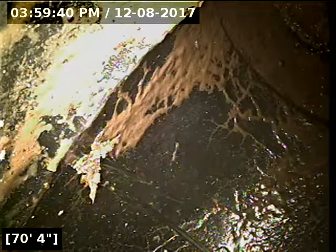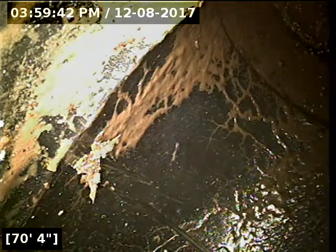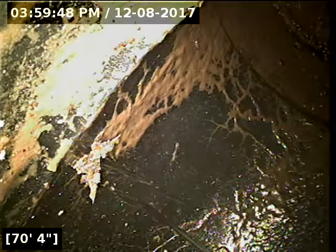A lot of these more rural towns have a variation or a STEP system — it's basically like a half-septic, half-city sewer line. Generally there's a tank that collects the solids, but the fluids don't always go out through a drain field. They drain through a pipe out to a main in the street. It's like a half-and-half system.